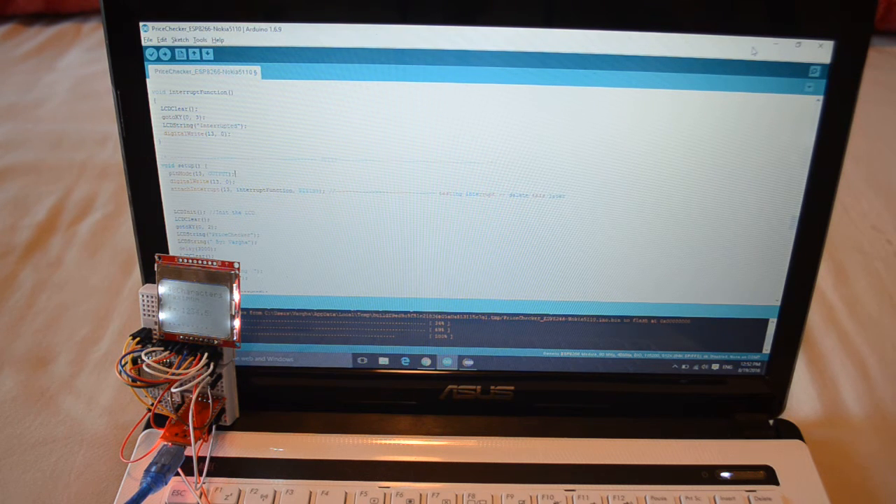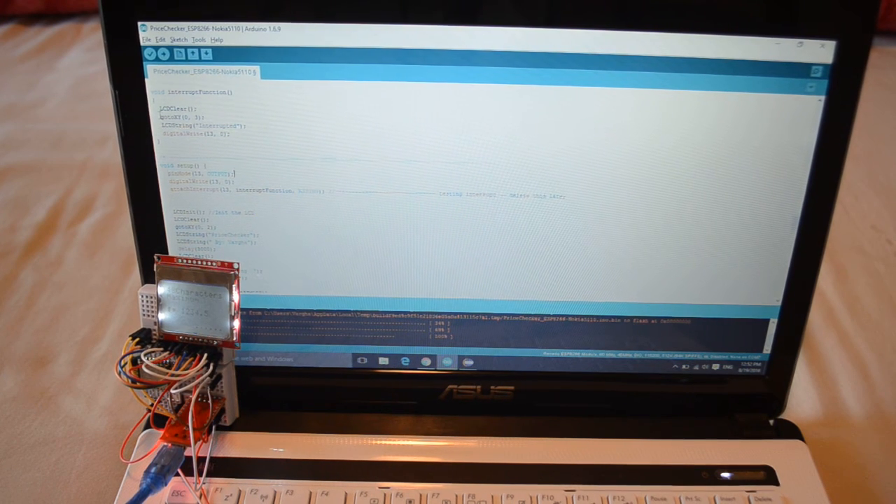So how are we going to do that in an ESP microcontroller? It's going to be so easy. There's just one key point. Interrupts work with signals, and the signal is going either up or down — digital signals are either going up or they are going down. You can set them to be rising, or going down — falling. Also, you can put them in a mode where it's either going up or going down, so basically changing.